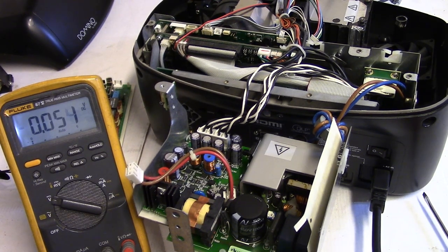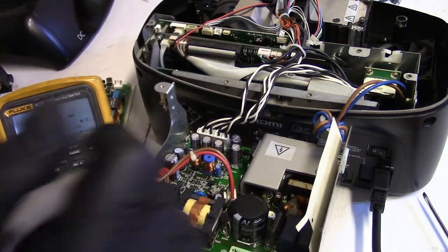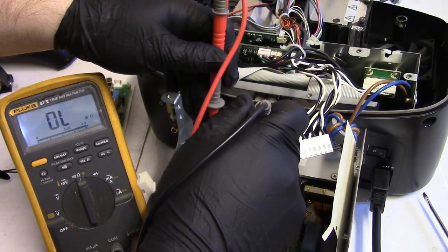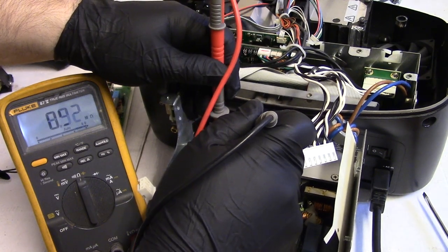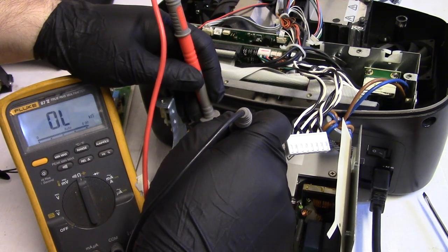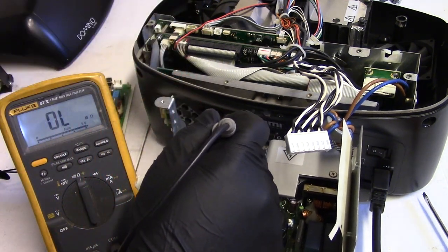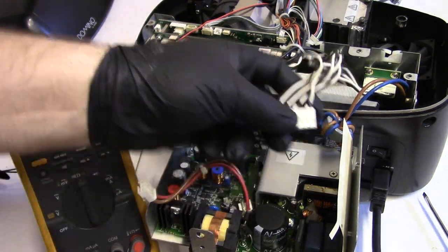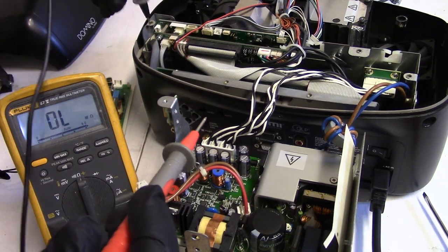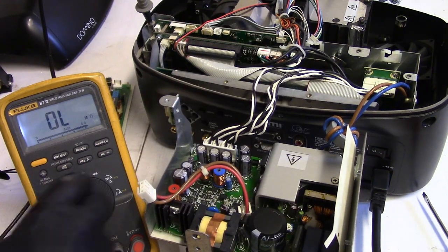So let's get these insulators off, and let's back pin the first two. Actually, are these all ground? Let's see something here. So it should be every other if we go black to black. Nope. So the last two. Alright, so this one, that one, and that one, but those two are not. Just wanted to get an idea. Because if I get one good ground, I'll just use that. I'm pretty sure if we just ground it to the body. Yeah, alright, good. Let's go DC.